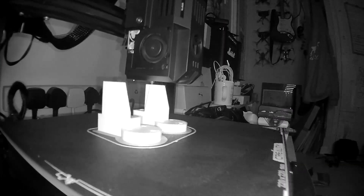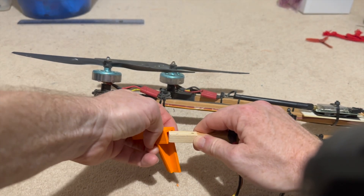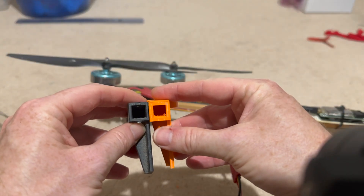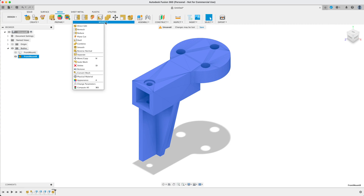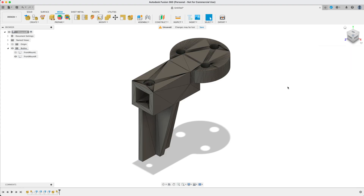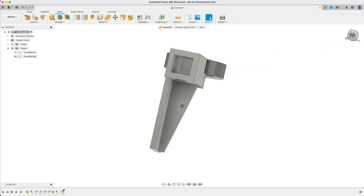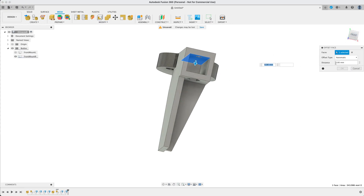So the first thing I did was reprint a couple of bits ready to put on, and then I found out they didn't fit because the inner holes on the original were slightly thinner than mine, which was weird. I was a bit stumped here because normally editing STL files is close to impossible, but I found that if I brought them into Fusion 360 and converted the mesh to a solid, I'd end up with this thing with lots of faces. When I selected two of the faces to extrude, magically all the other faces combined into a regular-looking model — so it was really easy to just select the other faces and push them all half a millimetre out.